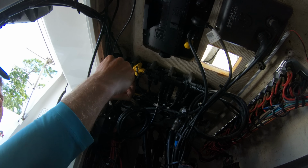All right, following the instructions, you want to hit Options, Settings, Communications, NMEA 2000 Setup. Go to your device list and look for the GT-10 temp sensor. It tells you to hit Review and choose a temp source. Now, it already seems like everything's set up, and it's reading the temperature right up there